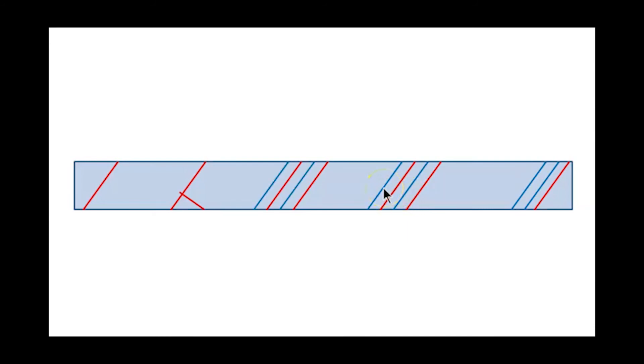So to summarise: we've taken a length of timber for our rafter, marked the bottom end plumb cut on the overhang, marked the width of our overhang, come down at least two thirds for our bird's mouth cut, used our run or half span measurement to mark the common rafter, came back half the thickness of the ridge board, and then from that same point again half the thickness of the rafter. Then from this run measurement, we've come down a rafter spacing and another one, as many rafter spacings as will fit on your piece of timber. From our creeper run, we've come back our creeper deduction, then gone half rafter to the left creeper and half rafter to the right creeper. And that is a basic pattern rafter for your commons, crowns and creepers.